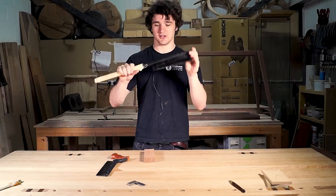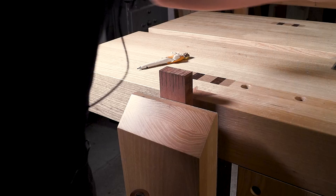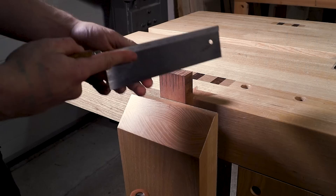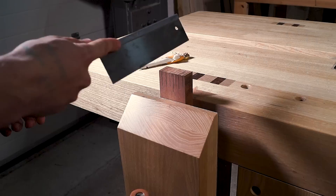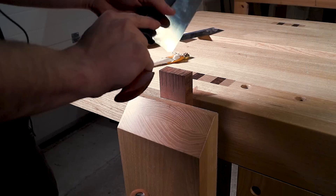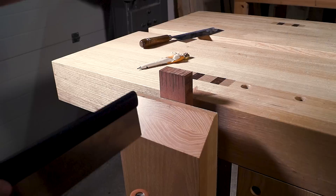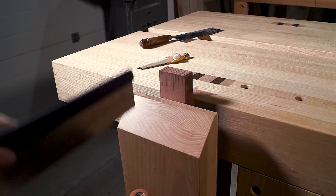The next thing is cutting these lines plumb. If you've watched my video on what saws you need - this is where gent saws can bite you because when you pick them up you have the potential to pick them up ever so slightly twisted. Following the methods just shown, it's entirely possible to get the line across the top perfectly square, but if you've tipped the blade somewhat it has the potential to start tracking sideways even though it feels like you've picked the saw up exactly the same each time. A pistol grip saw locks your hand in exactly the same position. This stage takes muscle memory more than anything - it takes a lot of practice.